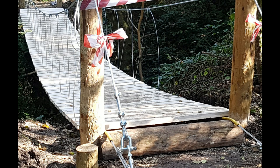Now, logically, you could not start this zipping up of the bridge from one end. It had to be done from the center. So the first thing was that working from the handrail, the wire was clamped, and then wires were taken down either side. In this case, we started with covering three planks. Wires were clamped then, and strap wrenches moved, adding strap wrenches now, and working further out from the center point back to the support posts.